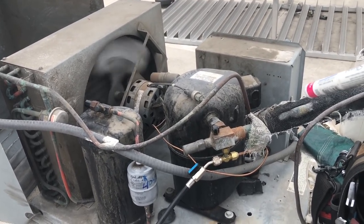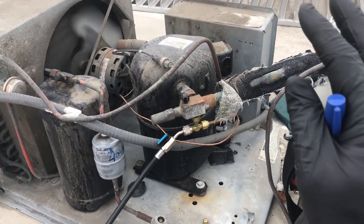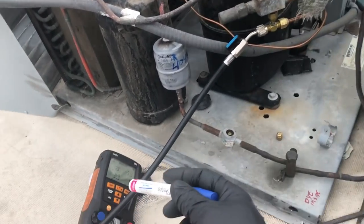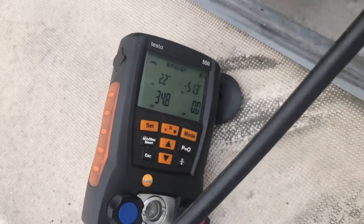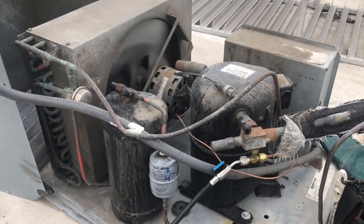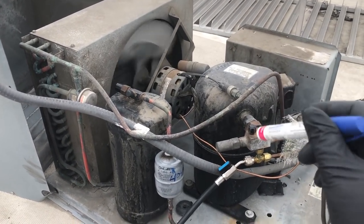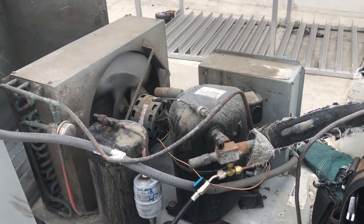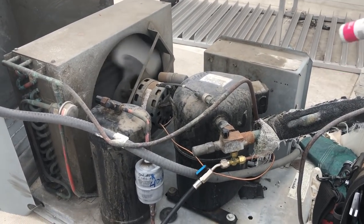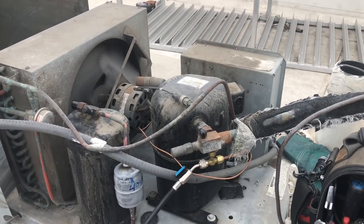This is a low temp system. They're using it as a refrigerator. It's not going to matter now. The box is going to pull down and cool off just fine. But if you didn't look this up and know it, you'd look at your suction pressure and think you got a bad expansion valve. That noise you're hearing also is a condenser fan motor, but it doesn't matter. I'm going to quote changing out this condensing unit and the coil to the right gear. So what I got to do is measure that box, the length, the height, and the width, and get some equipment that's sized for that box for medium temp.